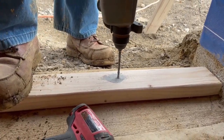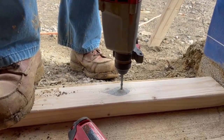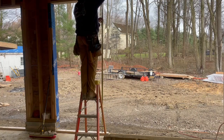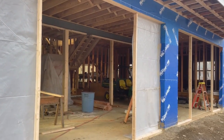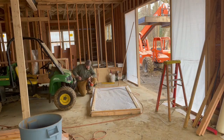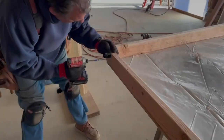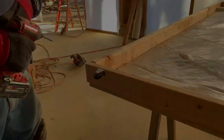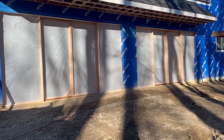Smitty came up with a way to block cold air coming in from the garage. We had some leftover poly from earlier in the build, so we fastened plates to the garage floor, measured the opening, and installed two four-foot-wide poly panels on each side. We then built four more four-foot panels to be used as doors, since we'll need to get in through the garage for siding and ductwork materials. Smitty found some small casters in his truck and we fastened them to the doors to make opening and closing easier.